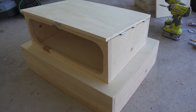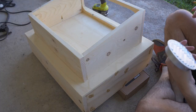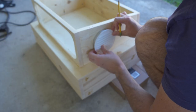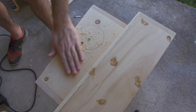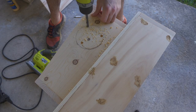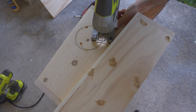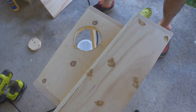Once all the hinges are added and the lid is in place, I then do another sanding using a high grit sandpaper to ensure that there is a smooth transition between the lid and the top. Next, I take two 4 inch louver vents and mark out where they need to go on both of the sides of the top. Once marked out, I drill a small pilot hole with my drill and then cut out the hole using a jigsaw. One thing to keep in mind is that you want to create this hole just large enough to provide a snug fit for the louver vent.